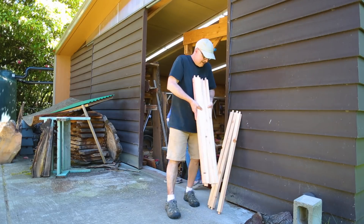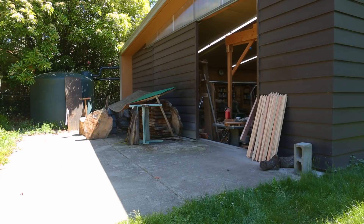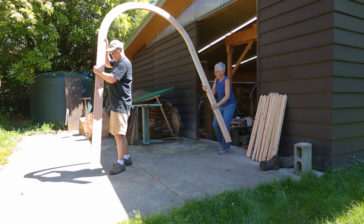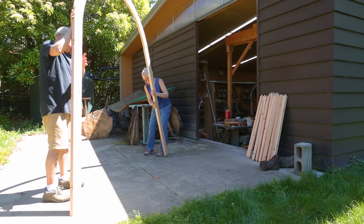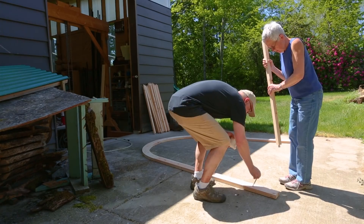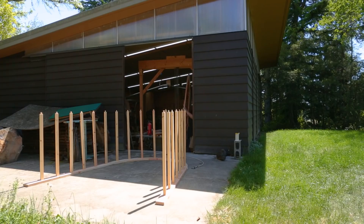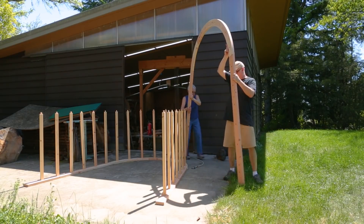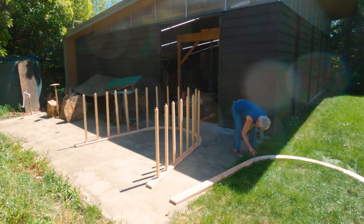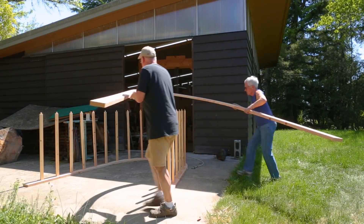It's big glue-up day and I brought mom back to the shop. I was thinking I'd glue it up inside but it would be difficult to get the full piece out of the shop, so we decided to glue it up outside. I really wouldn't have been able to do this without another person — these pieces are too big to handle alone. We glued the cross pieces into one side first, then brought the other half out. We put glue in all of the mortises, picked up the side, put it on the cross pieces, and amazingly everything went together.